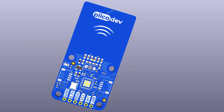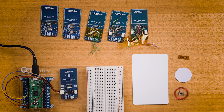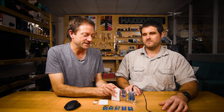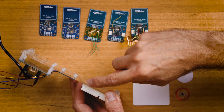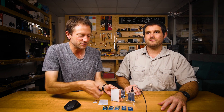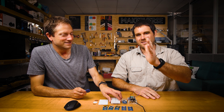So we've got the current working design revision here, Peter. One final question — why is the coil on the back? I'm not seeing any traces on the top side of this PCB. Well, we've designed this so that people might mount this on their projects flush with the outside of the enclosure. This is a simulation of the enclosure — our coil is as close to that as possible so you get minimum interference. It just literally lets you glue it to the inside of the box, and hopefully the other side is close enough to the coil that it will still read.